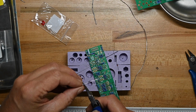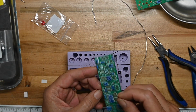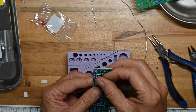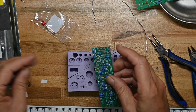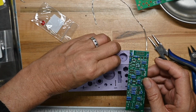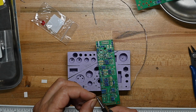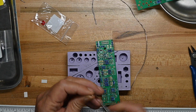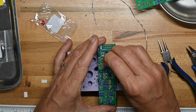I think he has the inrush resistor before the diode instead of after it. But I haven't traced the circuitry. And I didn't look at all the documentation on the Thonk website yet for this, but I didn't see a schematic. He may not provide one. Of course, we're making sure polarity is right, as always.